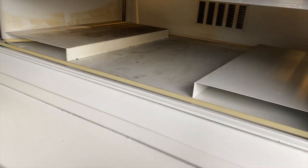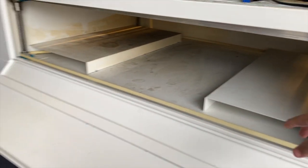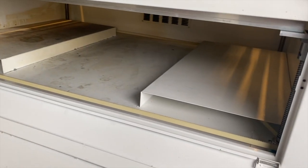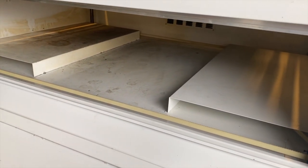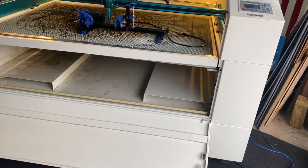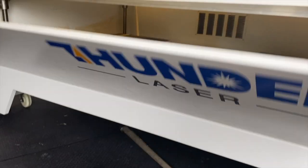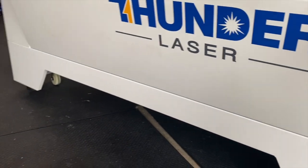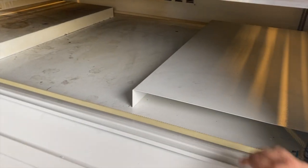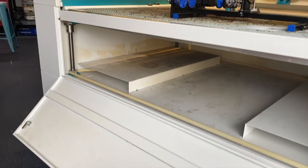There are probably a few other ways around it, but if I'm working with a large piece, I want to be able to move it up and down freely and take advantage of my z-table. Removing that bar has given me a little bit more access, and I searched the entire machine to see structurally what it would impact — I don't see anything. You can still close it up completely. Down below we are missing a collection tray, which they have added to the new models. I'll probably be retrofitting this one and building my own — I just don't want that debris sitting on the bottom.